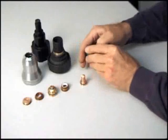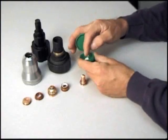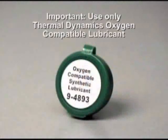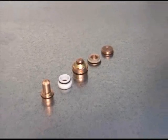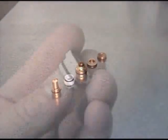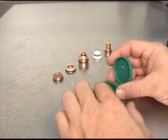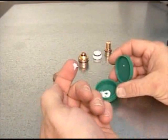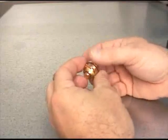When reinstalling existing parts, it is recommended that a light coating of lubricant — Thermal Dynamics part number 9-4893 — be reapplied to the O-ring surfaces. The lubricant should be applied very conservatively. Over-application can result in clogging the small orifices in the parts; a thin film is all that is required. This can be achieved by rubbing a small amount of lubricant between the thumb and forefinger until it becomes transparent, then gently turning each part against the lubricated fingers to apply a light film.